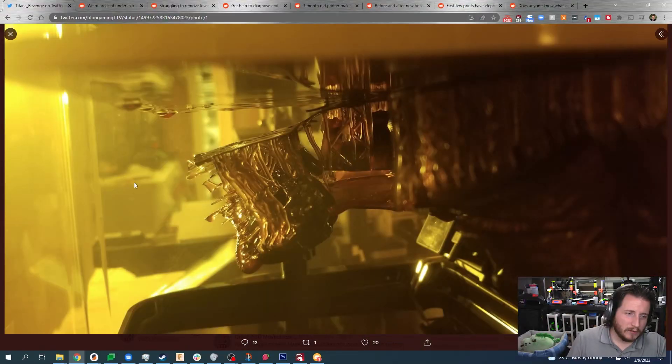This particular case could also be that your bed is not clean. If you have something on your build plate not promoting adhesion — like oil from your hands after wiping dust off — resin will not stick. Looking at the print, we also have another issue: this base is nowhere near thick enough. Normally you want at least four base layers minimum, something in the realm of 0.1 millimeter of hard base, then it slowly transitions to your normal exposure times.